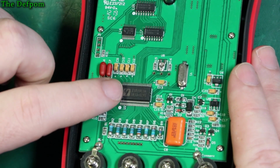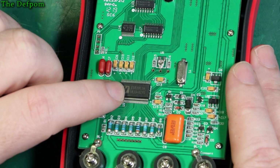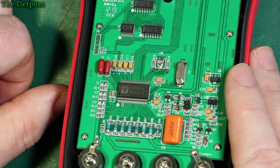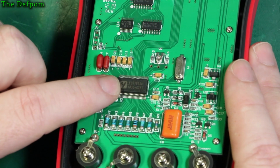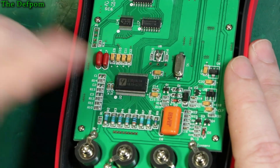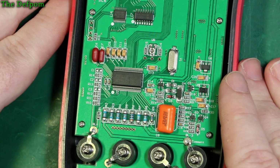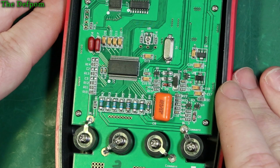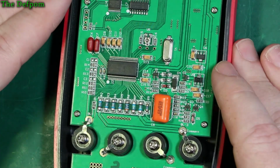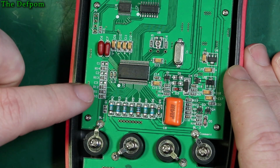Some other chip here. 1833. Really? 1833? I'd expect that kind of number in an HP piece of gear, you know, HP numbers. Anyway, it's probably just a coincidence. ETH 51920A, so it looks like. So we've got some little tantalum caps around the place, a bunch of those. Probably a voltage regulator over here, maybe another one there. Could be references. Entirely possible. There's a few unpopulated parts.